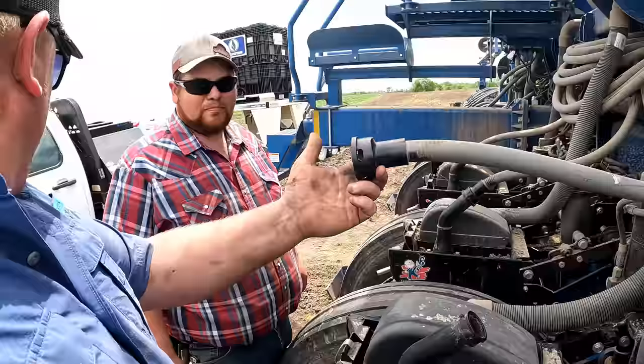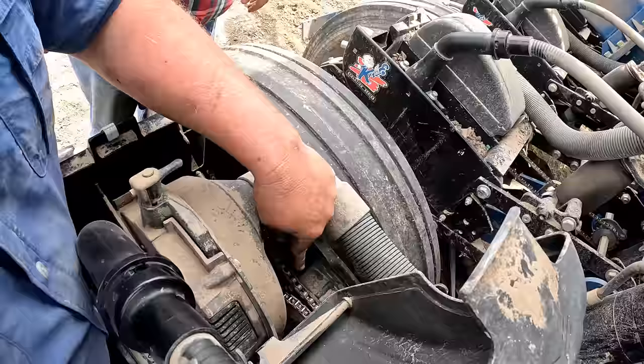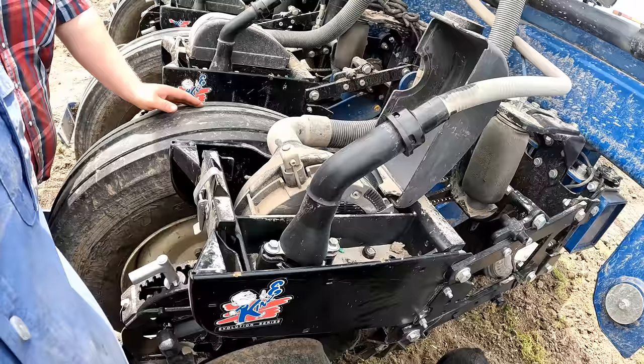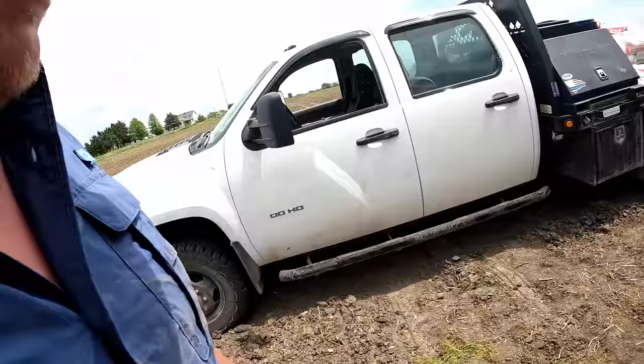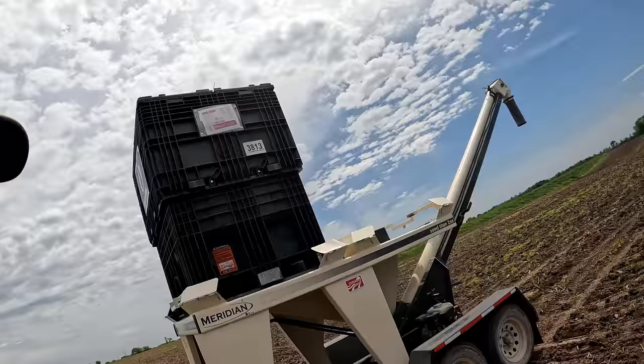And then I'll set it down, and you just have to look at me. And when I set it down, I'll hit the prime button, and this chain will spin. And then we gotta make sure that this jumper chain spins it. Because that's the row clutch right there. I looked at everything else and it might be a seed flow issue. It wouldn't surprise me if it's a seed flow issue, but I messed with the seed flow like 2 or 3 times.